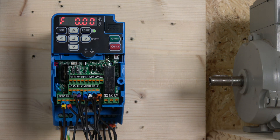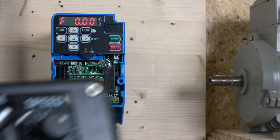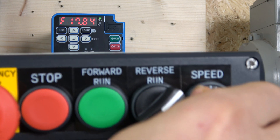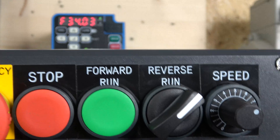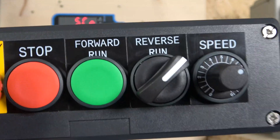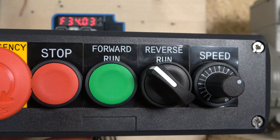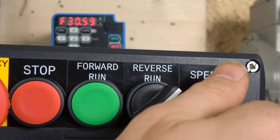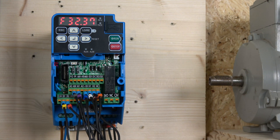Once you've done that and wired it up, you're pretty much ready to go. Put the station cover on — make sure you're in remote mode. Let's start: the motor is running. Stop it by clicking the stop button. If you go into run mode and hit the e-stop, it will error out, reset by itself. Once in run mode, click the direction switch — that was forward — and this is reverse.